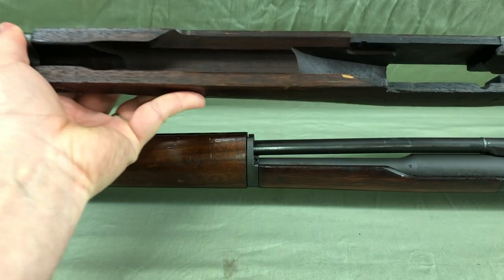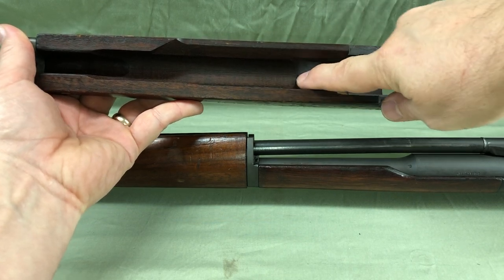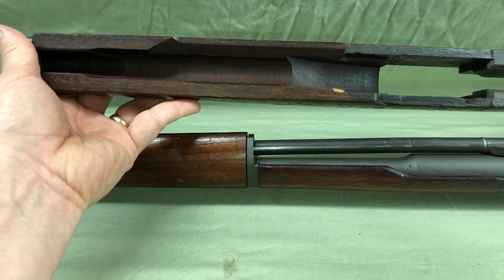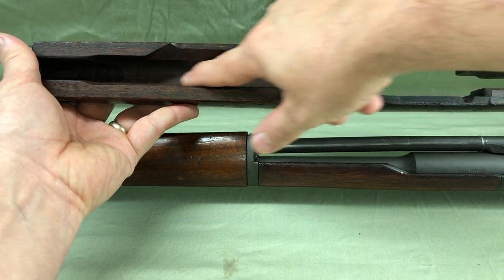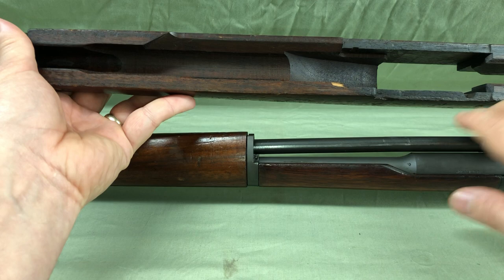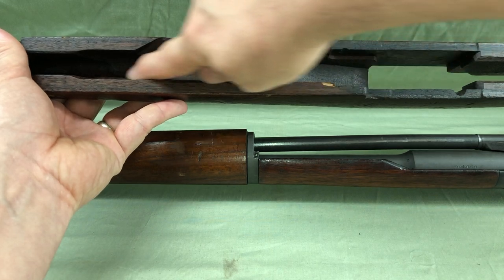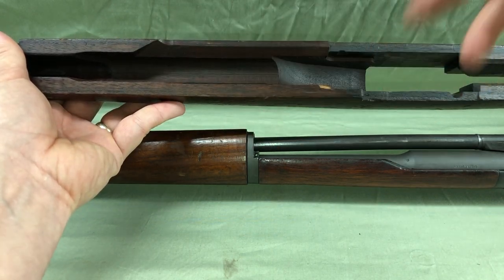This is a GI stock so you don't really have that much of a problem with it, but when you have an aftermarket stock — a weapon I built down at the CMP advanced maintenance course had an aftermarket stock. It was sliding in here and actually touching the barrel channel as the op rod was moving. I did the tilt test but when I set it up and put it into the rifle it was catching. I had to ream it out, rasp it out, sand it out — I think we used a Dremel — until it does not touch.